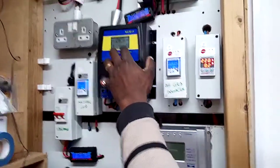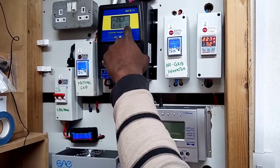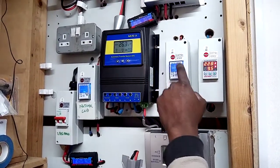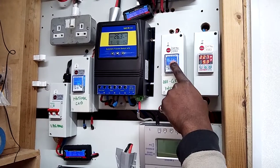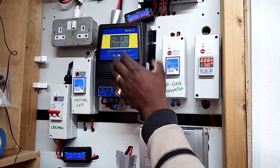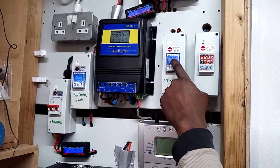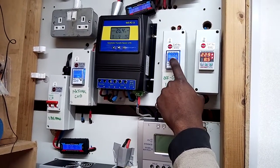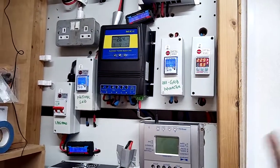If I don't have much sun and the battery is draining quickly, I wouldn't want it rapidly switching back and forth between inverter mode and the national grid. So I probably wouldn't want to sustain 1.7 kilowatts of load in that scenario. But what I'm trying to prove here is that I am able to do 1.7 kilowatts — my AC amps are around 7 to 8 — and I am genuinely exceeding the rated total capacity of this automatic transfer switch.